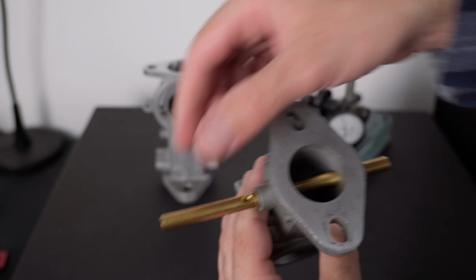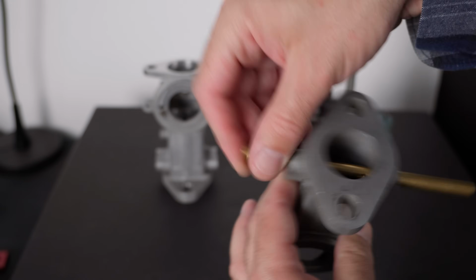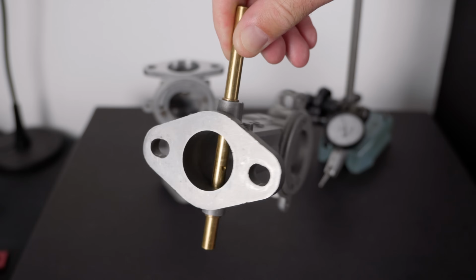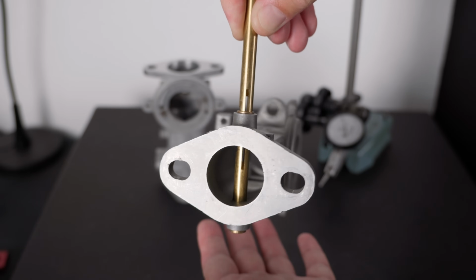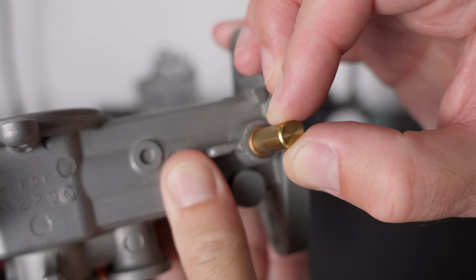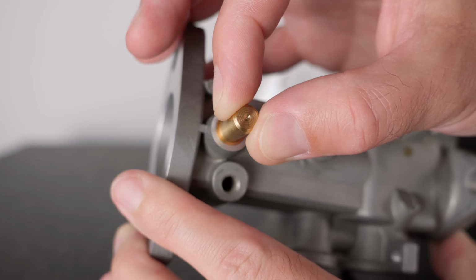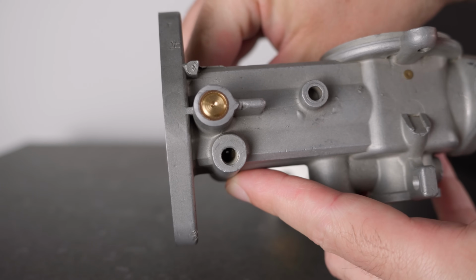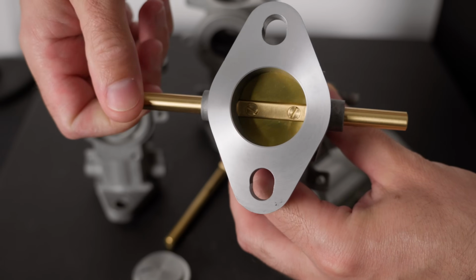I don't really know why the shaft feels stiff, because the reamer should have fixed that. But maybe the reamer, being thin and long, is bending a little bit, and the bushings may in fact be crooked? I don't know, but there's a difference, that's a fact. And not only in the way they feel, but also in terms of play. The ones I did today ended up with less play and a lot smoother.